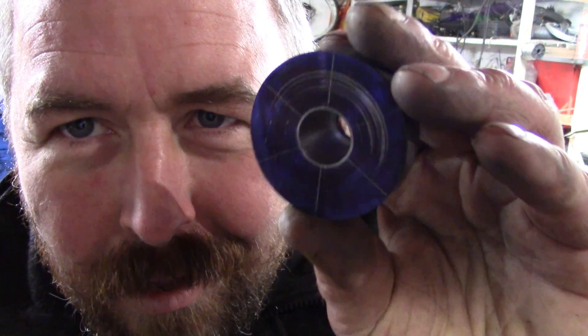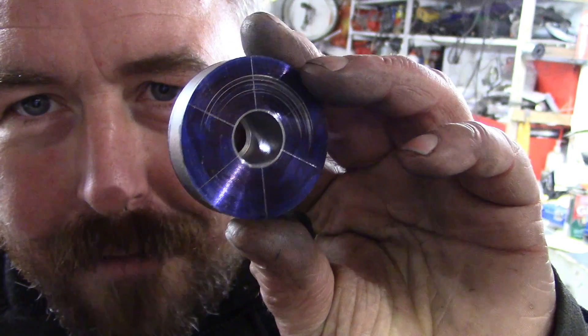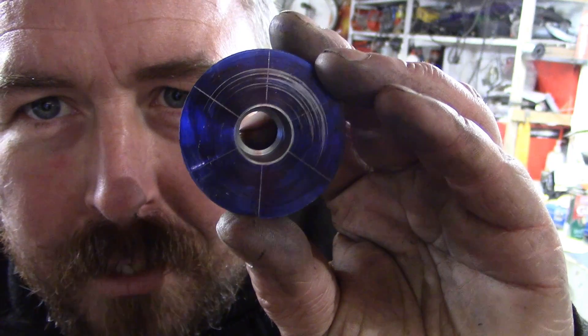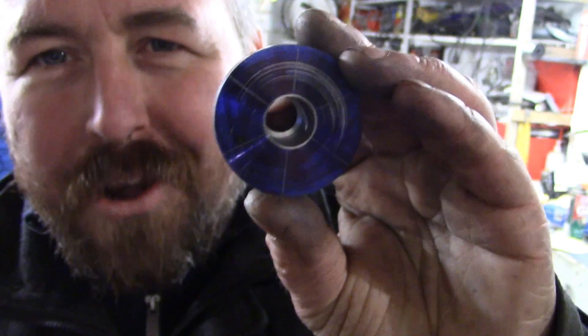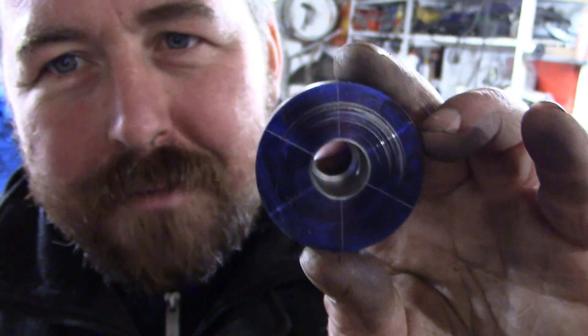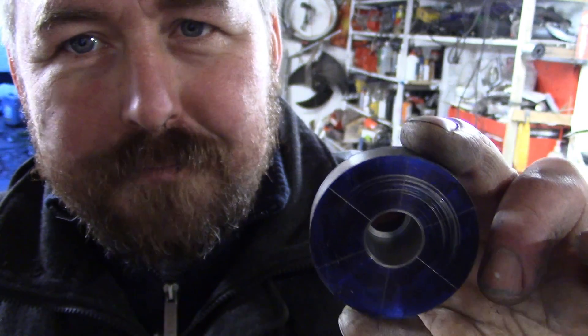Unlike the hub, this is going to be blind. There is a hole back there as far as the keyway — sorry, spline — is going to go, because there's a shoulder just before that hole. The spline nose is going to be blind because it's ending there. So I've got no idea how this is going to turn out. Worst case scenario, I might have to drill that out and find another way of securing it. But it'll be fun to find out — let's see what happens.